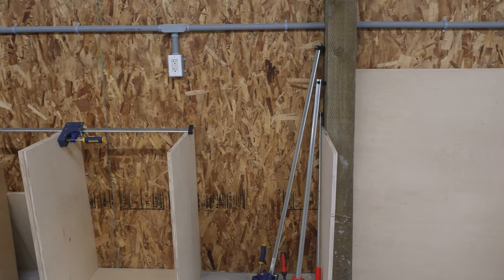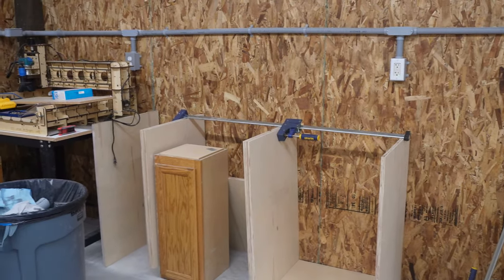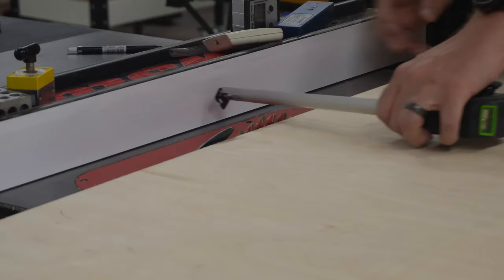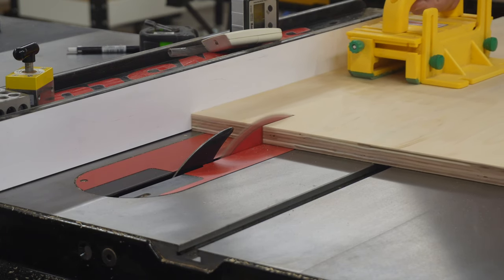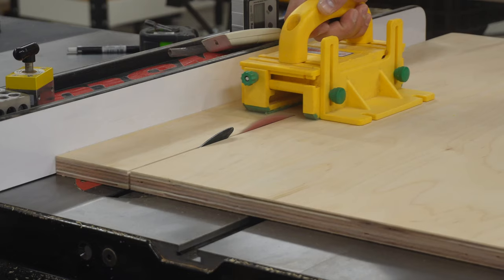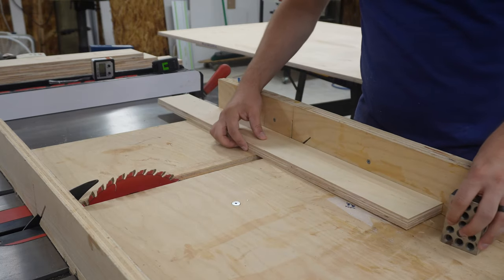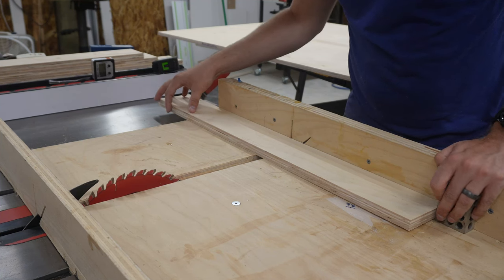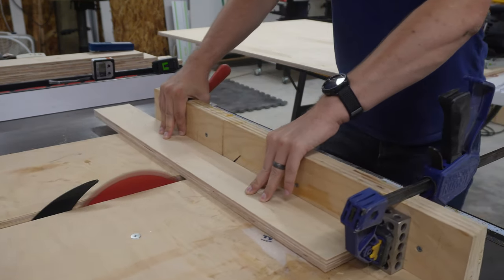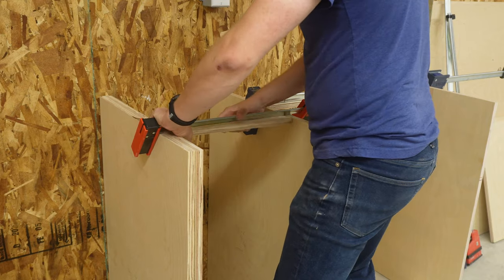Once I had all the sides cut, I set them up on the wall to get an idea of the spacing for each of the cabinets. I didn't have measurements ahead of time, so I used some clamps and test scraps to start taking measurements and cutting strips of ply to make the bracers and spacers — whatever these strips that go in between would be called. With those measurements, it was back to the table saw to cut those strips to about two and a half inches wide, enough to fit some pocket screws, and then I used a crosscut sled with a one-two-three block as a stop block and cut them to the lengths I had spaced out along the wall.